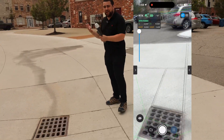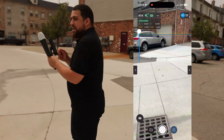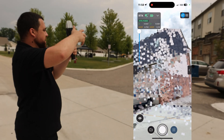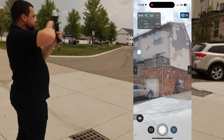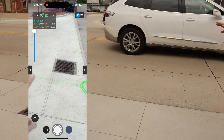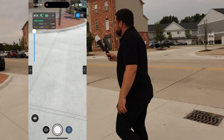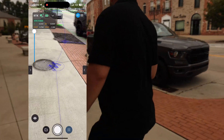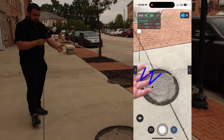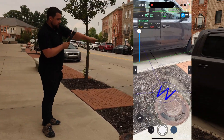It's so cool to actually see my CAD drawing in real life as I'm walking around. I can turn the point cloud back on at any time — there we go, referencing the point cloud in real life. It's a bit blocky since the point sizes are large, but I can make it more transparent to see the structures better. The design shows a manhole, but it looks like they put in a catch basin instead — all new concrete here, so they may have recently updated the utility. Heading further, I can see some blue line work: a gate valve and well, so this is a water structure. It says 'water' and the W label with blue line work confirms these two water manholes are connected to each other and then run off in another direction.